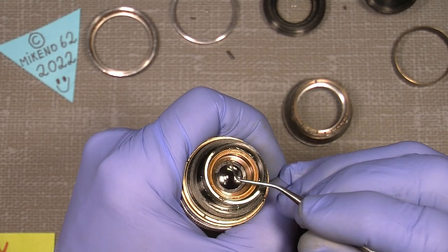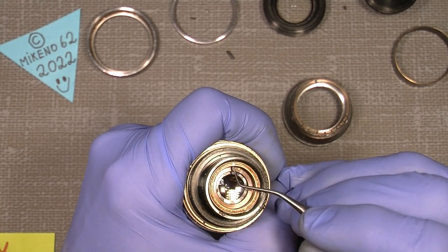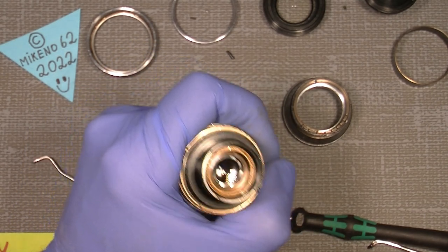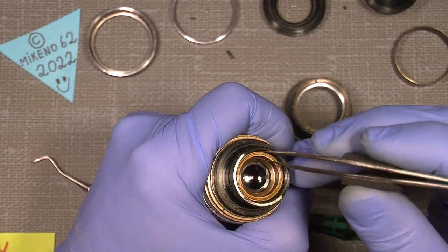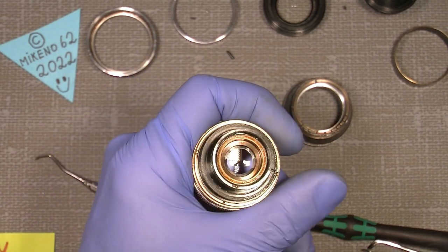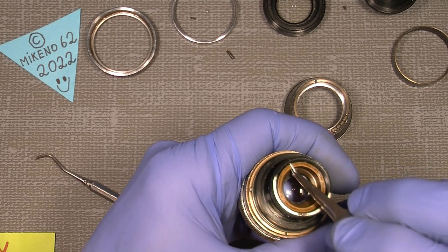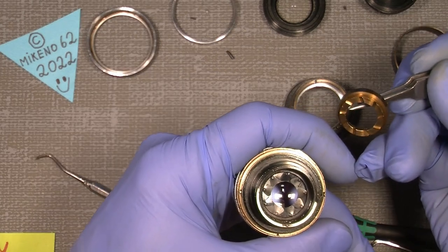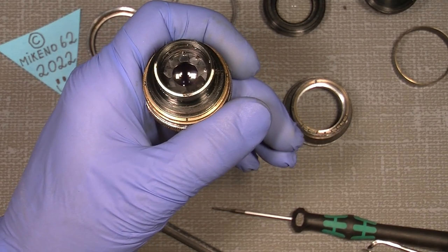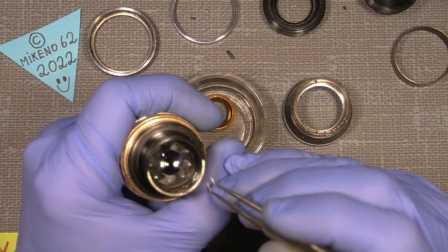I would think if I can lift up the aperture ring, maybe the plate will come with it. Well, I don't know. Maybe I will use another tweezer. Maybe this one will be fine. And this. I think the other one, the modified with the bended tip, can be useful in this case. And in that way, take it out. Then we are into it. And I think I will just put it in some isopropyl alcohol, 99%, and let it stay there a little.